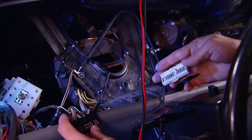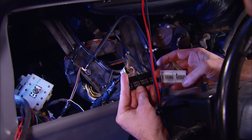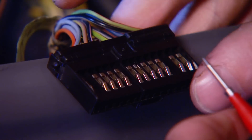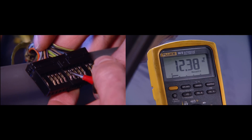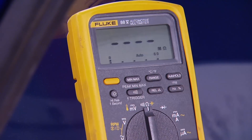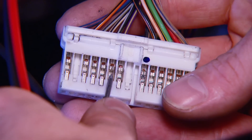The voltmeter is the simplest to diagnose. As long as you've got system voltage going into it and a ground connection on the other side, it should function correctly. Pin number 8, the green and yellow wire, is our battery or system voltage point — and we've got 12.38 volts. So we switch the meter over to a continuity test, attach the other lead to a good known chassis ground, and it's pretty obvious we've got a good connection.